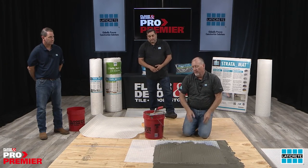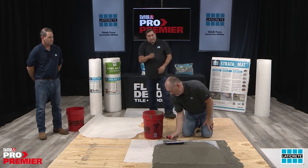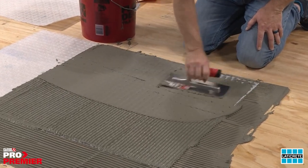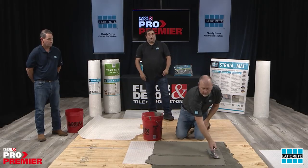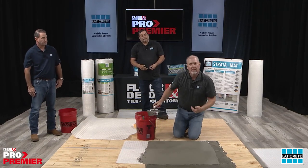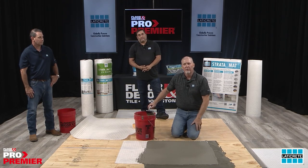What if it's end of day and you want to get your mat down but don't have time to tile? You can fill it, let it sit overnight, and come back tomorrow to install. The process: get the lines put in with the trowel, then remove excess thinset — basically burning it in, leaving just a minimum amount to fill all the cavities, then come back in the morning. One caution: don't leave the mat exposed to other trades walking all over it for a week — get the tile down over it quickly, just like you would with waterproofing.